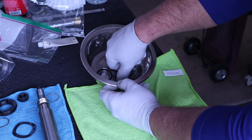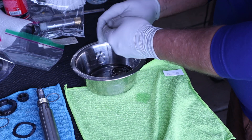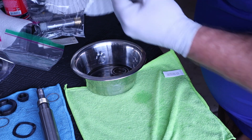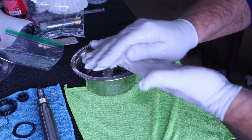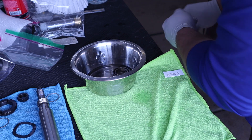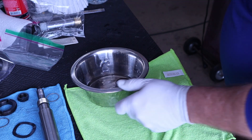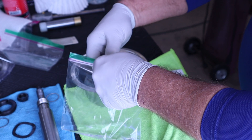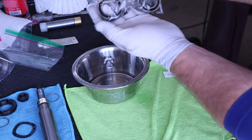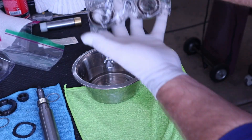Whatever you do, you never want to blow air inside of a bearing to try to clean it. Just gentle and slow as you go. I wish I had the ability to have new bearings for this. These aren't the most exactly sealed bearings in the world anyway, once they're inside the quill. So here's my bag with a little bit of isopropyl alcohol. I'm going to open it, give it a quick jiggle, and in it goes. The next bearing — jiggle and in it goes. Close it up. Whatever little particles walk off these bearings at this point will be left inside this bag. Then I will transfer them from this bag to the other bag where I will apply the grease.